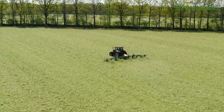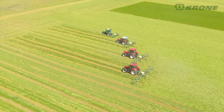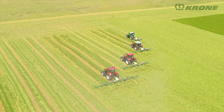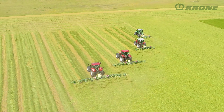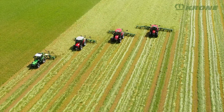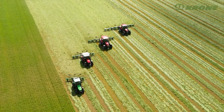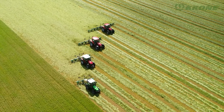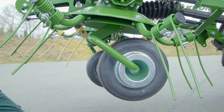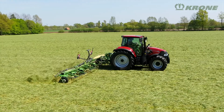Wilting times are reduced to a minimum. Depending on the model, the tedders have four, six or ten rotors of various diameters to suit different needs and applications. Small diameter rotors offer greater overlap and better contouring and are perfect for harvesting hay, whereas large diameter rotors are best for large-scale silage making. The angle of throw is altered without tools by refitting pins to one of four positions, to a steep angle for tedding and to a shallow angle for turning.